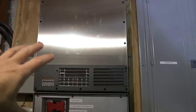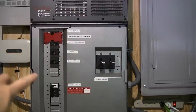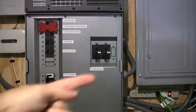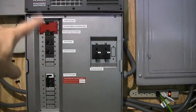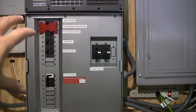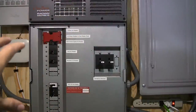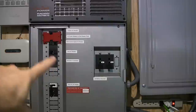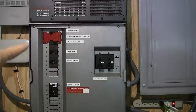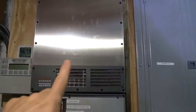Let me explain what I've done. I've de-energized the main inverter. Down below there's a combiner box which combines the mains electricity from the grid, the battery system below, into the inverter, and out to a sub panel. This system allows me to bypass the solar system and the inverter so that my main circuits don't die. This is something really to consider if you have a solar power system — in this situation, if I didn't have a bypass, my household electrical system would be completely down due to the inverter failure. Because I've got the switching system, I can bypass all of that and still have the sub panel and the house running. I need to be aware there will be live electricity flowing in here, but everything else is switched off to the system above, and we'll double-check that once I've taken the panel off.